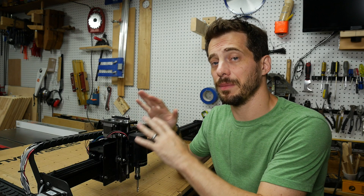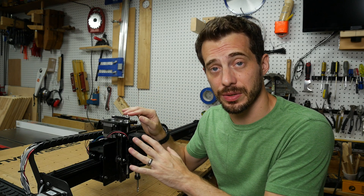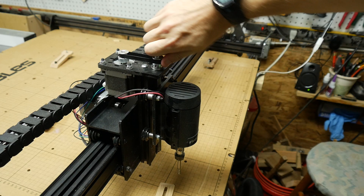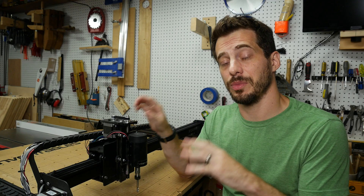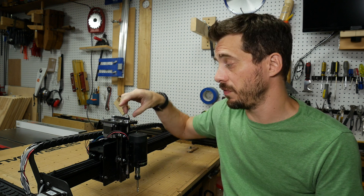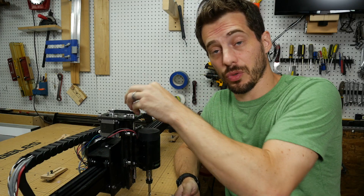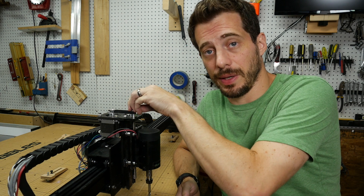So let's look at the problem. If I'm setting up my CNC machine for a job and it's not turned on, there's no good way for me to raise and lower the spindle manually. I have to turn this little nut up here and it's not very comfortable. So I'm going to show you how to make a really simple knob that will fit right over this hex nut to make it really easy to turn. The first step is to measure the real-world thing we're going to be working around.